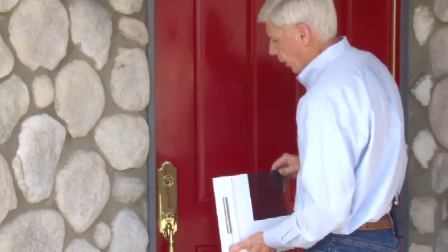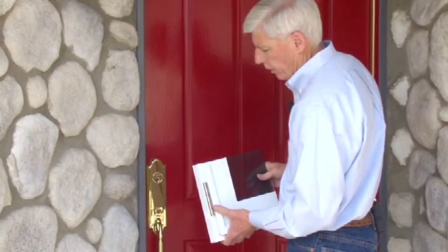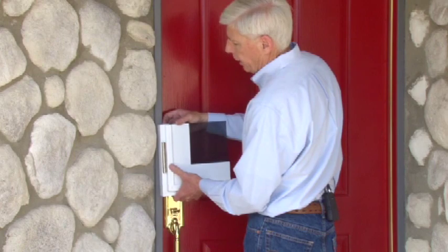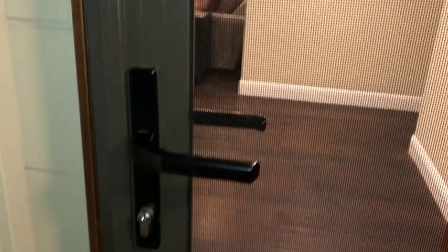And just like with our sliding doors, the swinging doors are the same principle. The rule of thumb is that you only want to go over 1 inch from the inside dimension to the outside on each side. So from the inside dimension, which in this case is always going to be the dimension that is the shortest in the width and in the height, you're going to add an inch to each side, so there'd be 2 inches overall for an outside mount system.